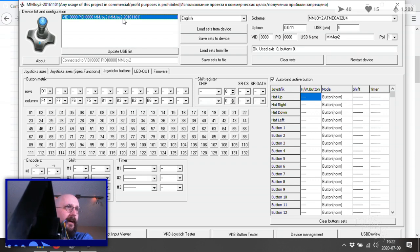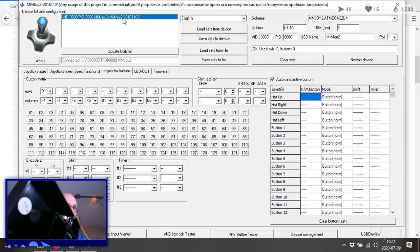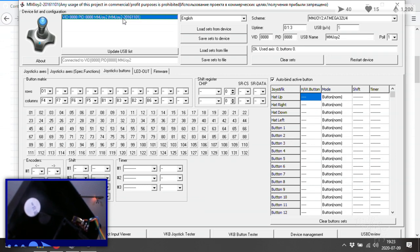Okay. So one of them works. Two. We've got up, down; left is not working, right is not working. Okay, trigger is not working. Pinky's not working, but pickle is working. Okay, this leads me to wonder if it's just... Oh wait, yes, when we start bending the connections, the DuPont wires, we start getting ones that were not working suddenly working. So it could just be that this is a bad board that I've got here. It's not making all the connections it's supposed to.